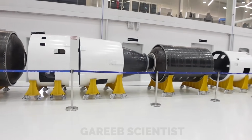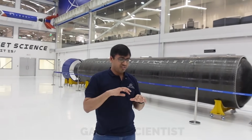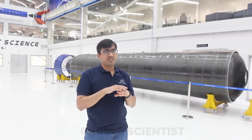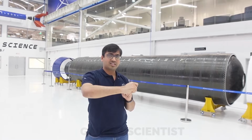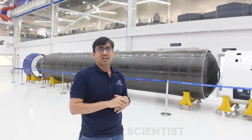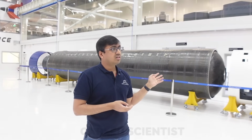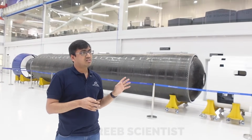Building it straight from the equations is very challenging. There are a lot of fundamental equations which define how the stress distribution happens, how we have to wind the fiber, what direction it has to go. And there are factors like the friction factor, which, if you don't maintain it, the fiber starts slipping as you wind. And when it slips, the whole hardware is gone. You have to build everything again. So it's quite challenging, but I think we have mastered it in a reasonable way so that we can make lightweight structures, because margins on these are not very large.